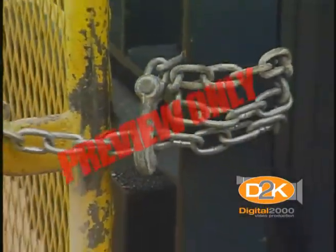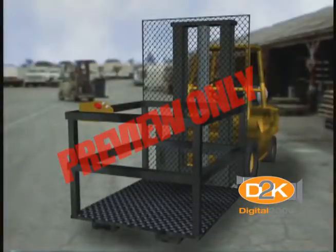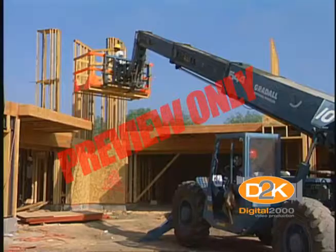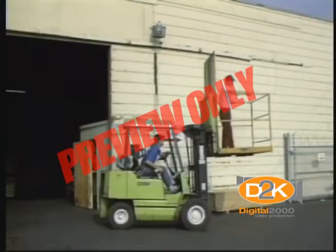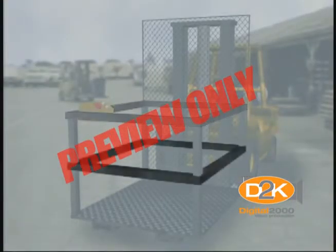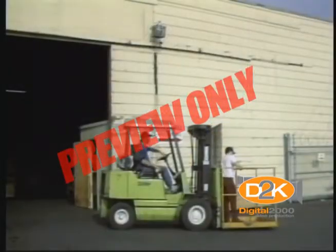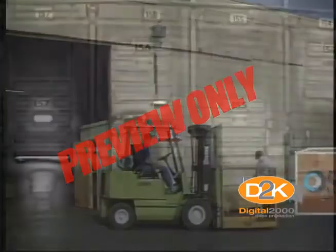The safety platform must be firmly secured to the lifting carriage and/or forks. Means shall be provided whereby personnel on the platform can shut off power to the truck. If there is a forklift operator, this requirement is not necessary. Generally, a safety platform used to lift people on the forks must have a 42-inch high guardrail, a mid-rail, and a safety barricade or screen that is 7 feet high. This screen prevents the person elevated from getting hands caught in the mast during elevation or lowering of the mast.